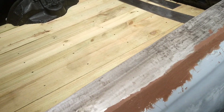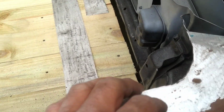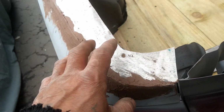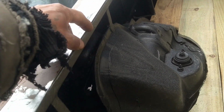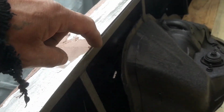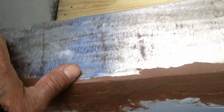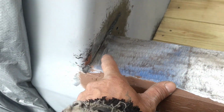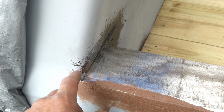So let's get it. All right, boys, this is the following update. Everything is dry, solid. I bought me an extra can of bondo glass. I kind of ran out yesterday, but I didn't want to fill it yesterday because what I want to do is tag it in some spots over here so it's not floppy. Right now I could leave it like that. We could have seam sealed it with glue and sent it. So I'm gonna weld it from here through there, a couple tags, grind it down, and we're gonna fully cover this in bondo glass so it's got protection and it's harder. Debating whether I weld it to that itself too or just tag it there and we seam seal it with the bondo glass. We still gotta do a little piece here with metal that I'll do after. I just wanna do the release itself. But overall, it's looking good. Without further waiting, let's get to it.